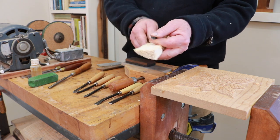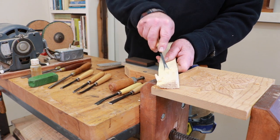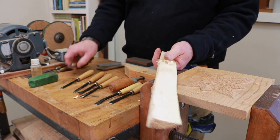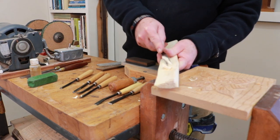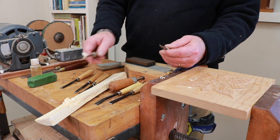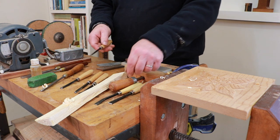With the grain, right now this will still cut, but it doesn't cut real well — I can feel it dragging and it kind of tears it. This is white pine. This is not too bad of a cut, but compared to my quality gouge, I find it so much smoother. The difference, other than the obvious size, is that this edge is not going to hold up. But the beauty of it is it's easy to sharpen again. I would say you're limited to staying with really soft woods, like basswood or white pine.